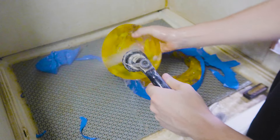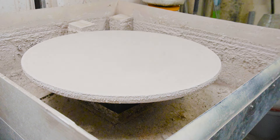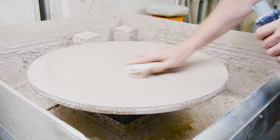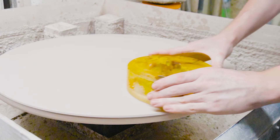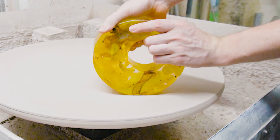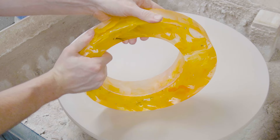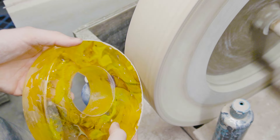We're going to give the rings a quick cleaning to remove any excess grit and once that's done it's time to begin the polishing. This is done by putting cerium oxide onto a felt wheel and scrubbing it in with a brush. This part of the process is actually one of my favorites because you get to finally see what the true color of the glass looks like. But you also have to be very careful because while you polish the glass it actually builds up heat, and if the glass gets too hot you could end up cracking it and ruining the project. To polish the edge of the glass we're going to be using a large wheel for the outside edge and a small one for the inside.